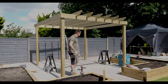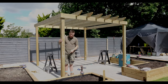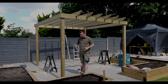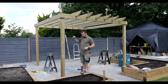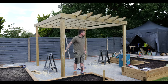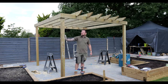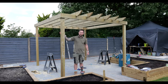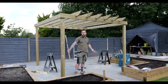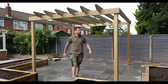Now we're going to clean everything up and put some concrete screws from the posts into the ground. When we laid this patio we put extra concrete — the base is about 60mm — so we can put pins in just to hold the posts in place; the weight looks after everything. The customer is going to wrap some fairy lights around here, which will look super cute. They're also thinking about putting some climbers — maybe a honeysuckle, jasmine, or even a grapevine — something to grow up it. And we're done!